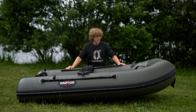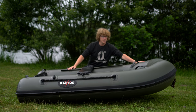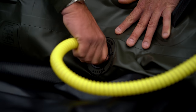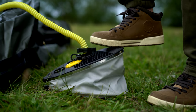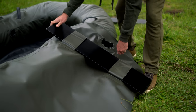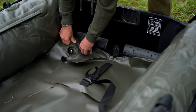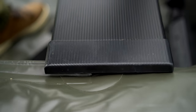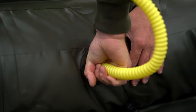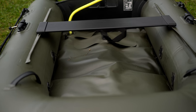Here the boat is in its fully inflated state. To get into this position you need to follow a certain order. You've got three main chambers — the front is chamber one, this side is chamber two and that side is chamber three. You inflate those to about a third capacity, that gives the boat a bit of rigidity and a main shape, and then you need to put a few other things in place. You start off with putting the air deck in — there's a wooden support bar that goes underneath that, just to give a bit more strength where your feet are going to be. You slot that into place and then slide the aluminium seat into place as well. Once those are in position, you fill up the rest of the three chambers to their full capacity, followed by the air deck base and lastly you inflate the keel.